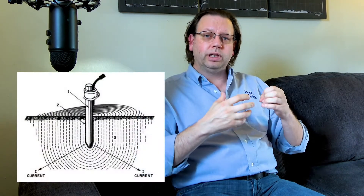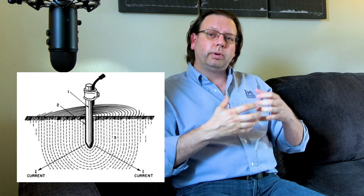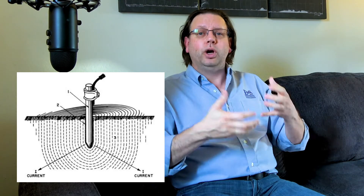Why is that important in a substation? Our substations have two basic components: a horizontal grid, generally made out of pure copper, and a vertical component system — our electrodes. The horizontal system balances our voltages; the vertical ground rods get rid of current. One ground rod will get rid of more current out of its tip than a hundred feet of horizontal conductor — that's how efficient they are at handling leakage current. Our whole point is to get rid of currents we don't want, into the earth where there are lots of atoms for those electrons to tie orbits to. The tips of those ground rods do a lot of the work and tend to corrode faster.